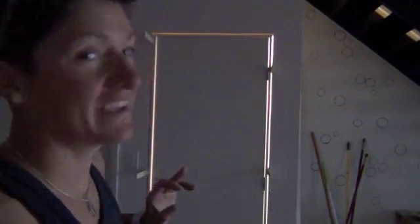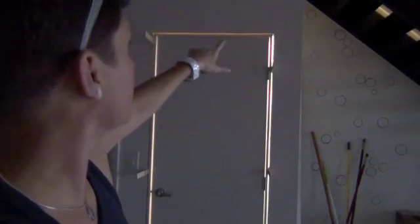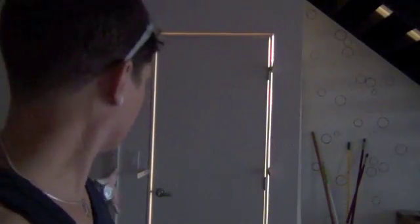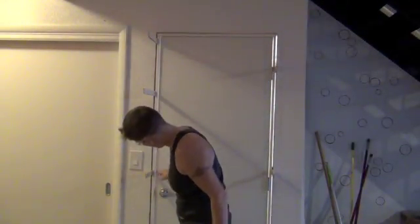So I can tell by the top here that this side is a little bit lower or a little bit higher than this side, so it's a good thing I only have just nails holding that in, so I can kind of pry it from the bottom and raise that up a little bit, and make any adjustments to the shim along the sides if I need to, if I find it's about the same all the way.